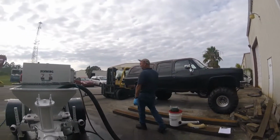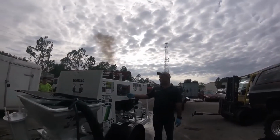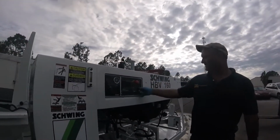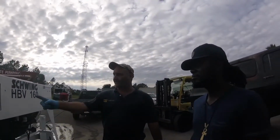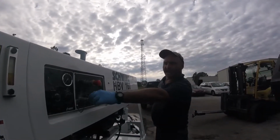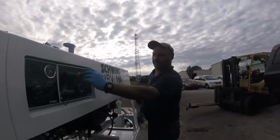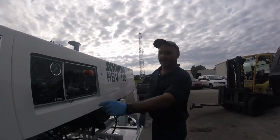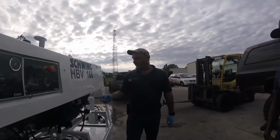safety. So let's take a look at safety. Okay. That's your e-stop. The reason you can tell your e-stop hasn't come on or has come on is you don't hear the click on the motor. Hear the click? So if you hear that in the morning, that's your fuel relay opening up. Okay. That's what those e-stops regulate.